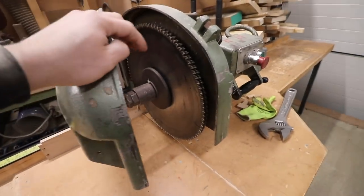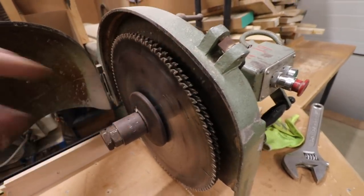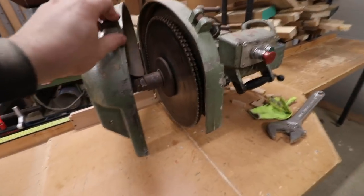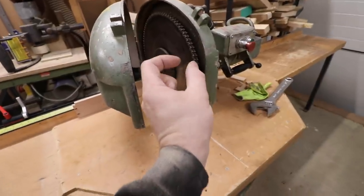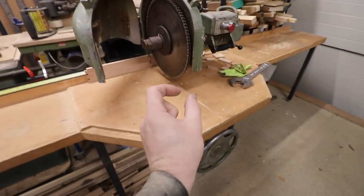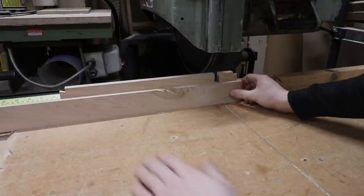It's called a dado cutter, but a dado cutter will actually cut out all the material in the middle. This is a little bit dangerous in that it leaves a strip in the middle that's uncut. So I wouldn't recommend doing it like this at home, but you need a method really of cutting a halving joint where the two cuts are perfectly parallel to each other. And once you've got that method, then you can thickness your timber to suit the right size to that cut.